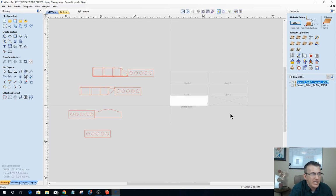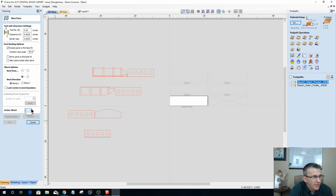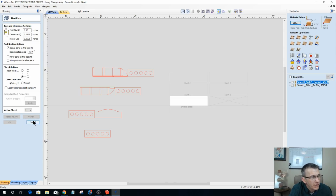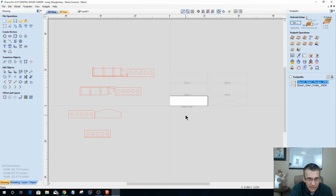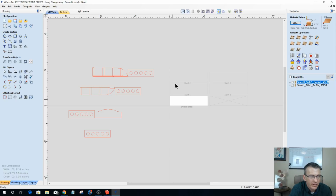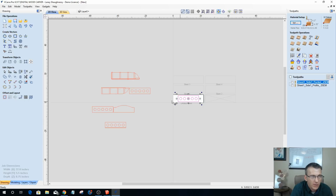All right, now I've got all these sheets and everything because nesting is kind of active, and there's really no way to reset it. So you're going to see these different 4 sheets here, 4 boards. And I may keep nesting, move things over, but all I know is this guy right here, I'm going to hit F9 and get him on my board. The toolpath I create for him is going to cut basically 4 boards, 1, 2, 3, 4, my 4 shelves identically.